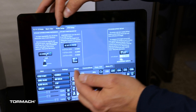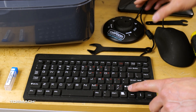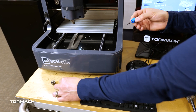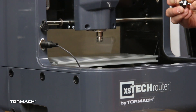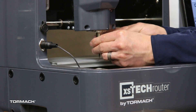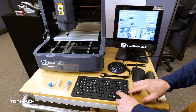We've now referenced it. Let's go ahead to our next section which is going to be our ETS position. For this one I'm getting the probe out of the way — we're going to put our tool back in. Same setup as we did earlier. I'm going to use that exact same point and this time I'm just going to tighten it hand tight because we're going to take it in and out a couple more times. I'm not going to use it for milling, just for positioning, so we'll go ahead and go back to that back corner.